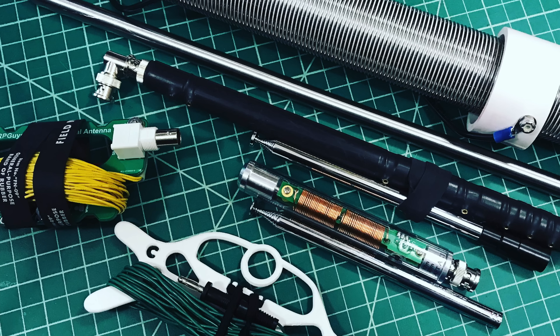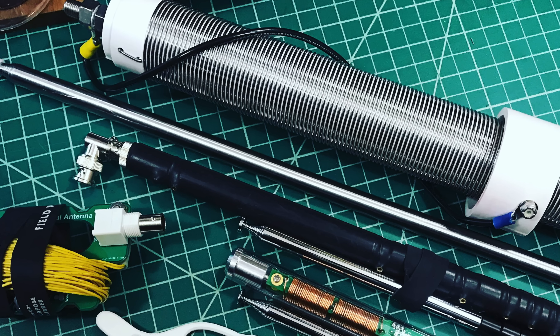A note on tuning time: I mentioned adjusting the collar up and down to find the resonant frequency. What some people do is take a Sharpie marker and mark the antenna base on the coil where the resonant spot is for a given band. That works, but every time you change the whip or do something different, you'll have to readjust and those lines may move. What I've found effective is to also take a picture. Just keep in mind that marking gives you a general area of operation — you're still going to fine-tune by moving the collar up and down and rotating it to adjust the SWR.